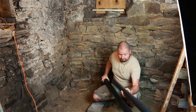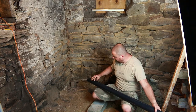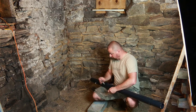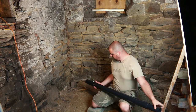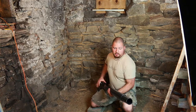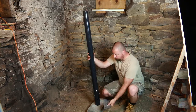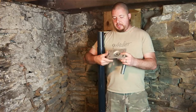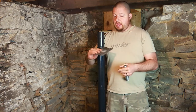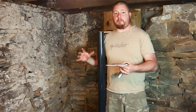For us, we're just going to go down through the bottom. We slide it down through — they have two of these bolts — press that through, turn it 90 degrees, and just press the other one through. You don't need to make these super tight; I just finger tighten them. We have two base plates and they have these raised dimples. Those dimples go up — that holds it in place. On these plates there are four oblong holes, and when we stick these plates down, you can either lag them into your floor or lag them into your beam or joist. That way it gives more stability and eliminates the ability for this post to kick out.